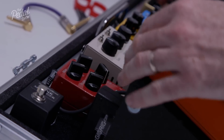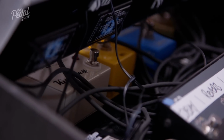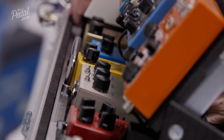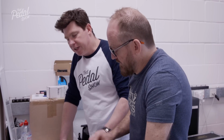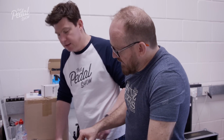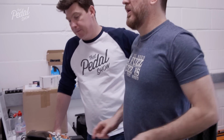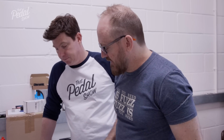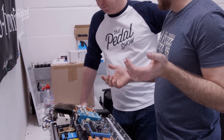Okay, so the way this works is, this is the Page ODS, which is the overdrive channel of the Double Overdrive Special, configured with this. This is basically the clean channel of the Dumble, and the way the Dumble works is, it's not a whole separate channel. It just engages another gain stage basically at the end of the clean channel, which is exactly what this does. So when you engage this, after this, you get the Dumble overdrive channel.